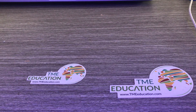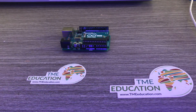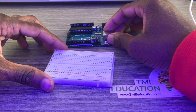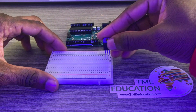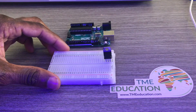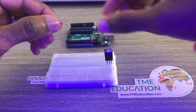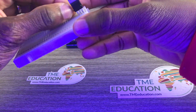Let's dive in. I need an Arduino Uno, also a breadboard — it is essential for our project. I've got the TIP120 NPN transistor, a power transistor. I've got a 2.2k ohm resistor; one of its legs is going to the base of the transistor.